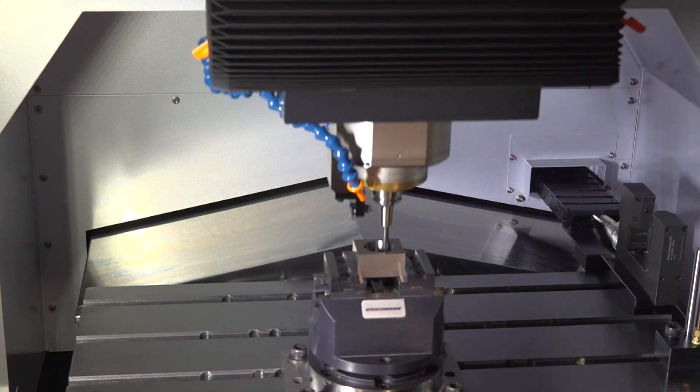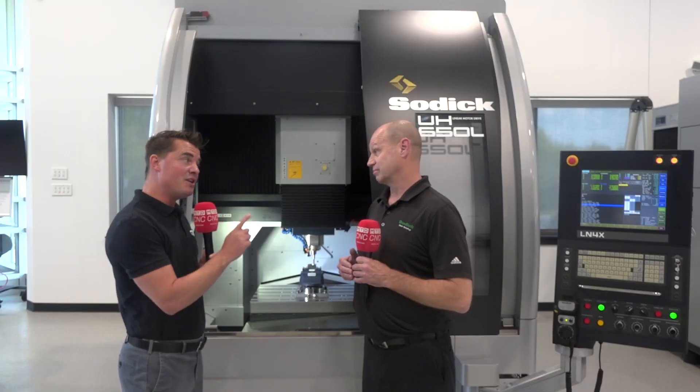Light, fast — that's high-speed milling. We don't have to take heavy cuts, and we don't even want to take heavy cuts with these machines. We start wearing out spindles that way. The whole concept is light and fast machining. Speaking of wearing out spindles, you guys have the ability to have extra chillers and cooling partners to prevent thermal expansion from overrunning a spindle and breaking it down.